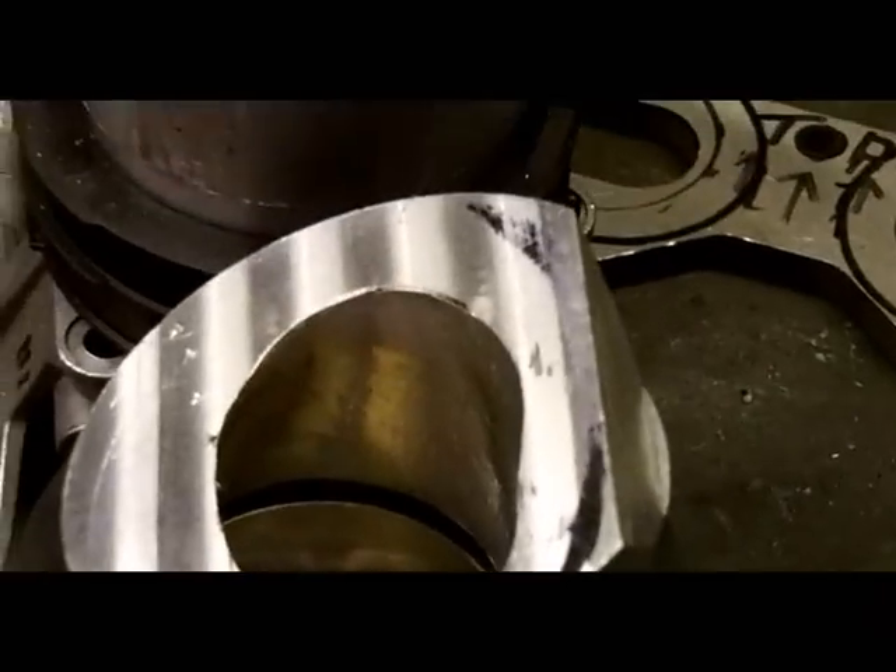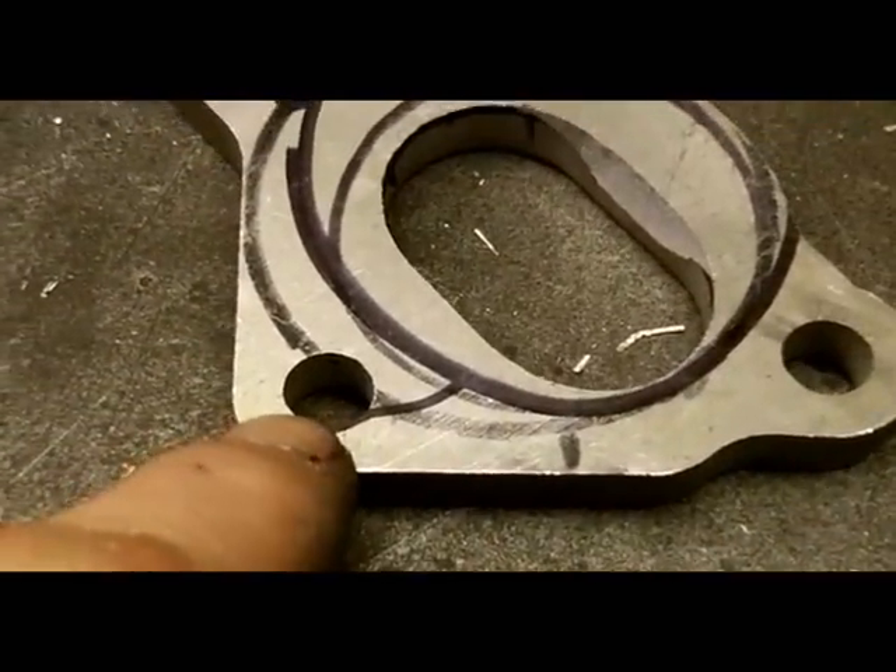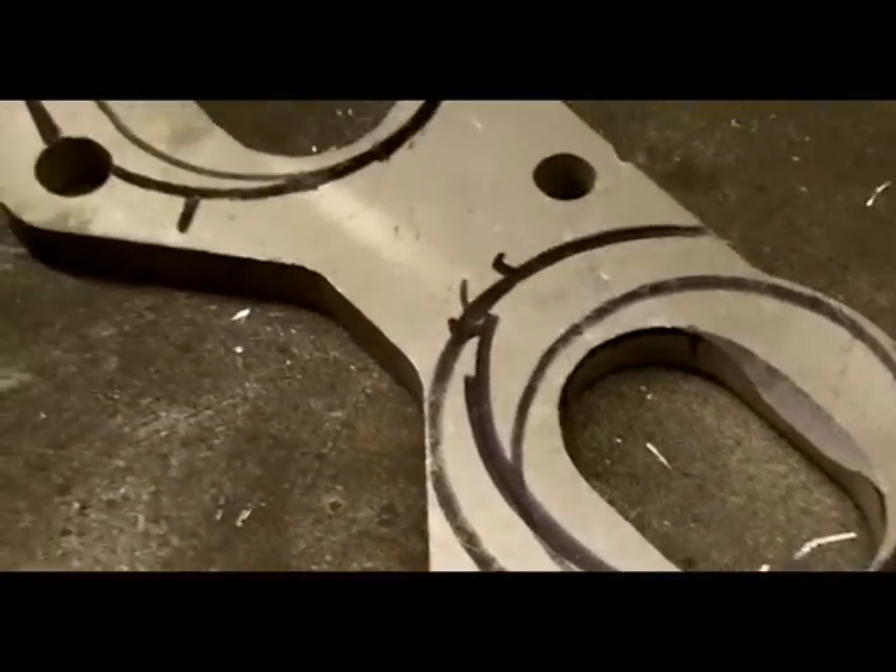You can see here that I start off and just mill the edge of it before I put it into the linisher and smooth it off a fair bit. The reason I'm taking the edge off of these is simply to clear this hole here on the manifold itself.